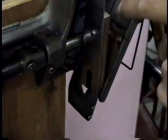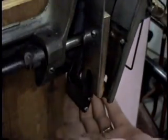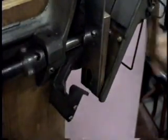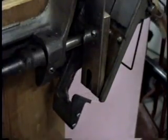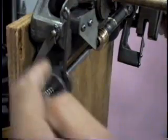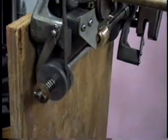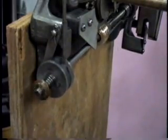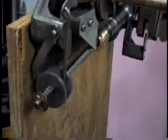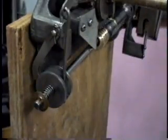Here's a close-up of me dropping the penny in and that finger coming to get it. A close-up shot of the clutch with the fixed arm. If I turn the crank in the right direction, it's allowed to raise up. If I turn it in the wrong direction, it drops out. So this gear is either engaged or not engaged.